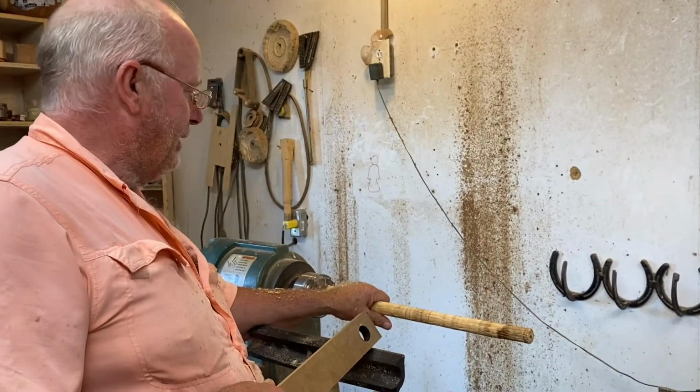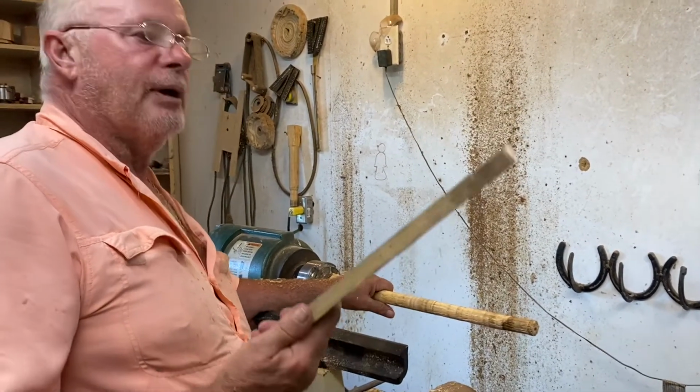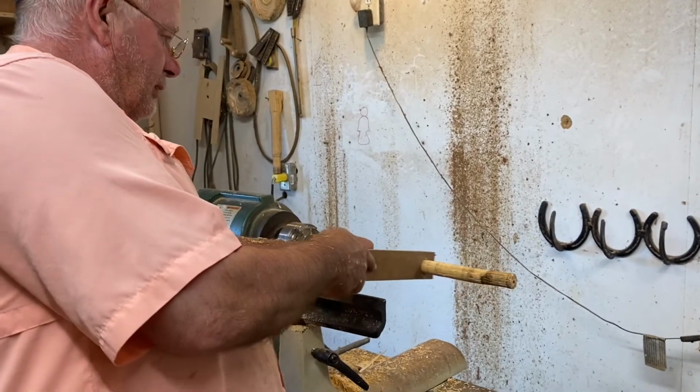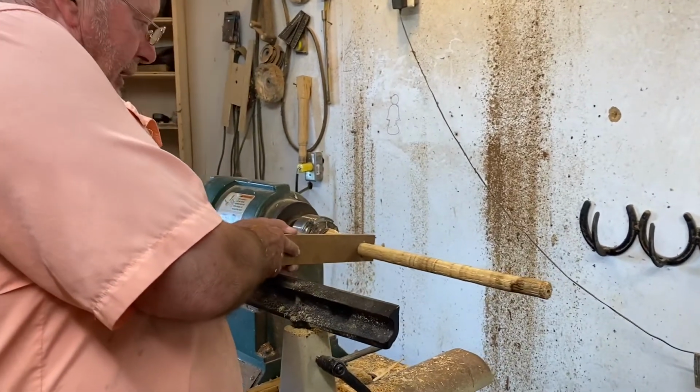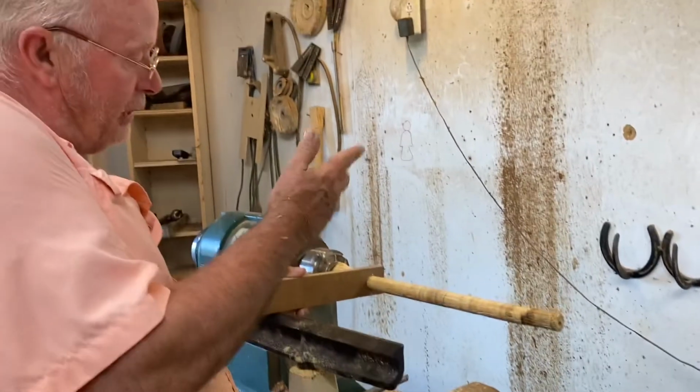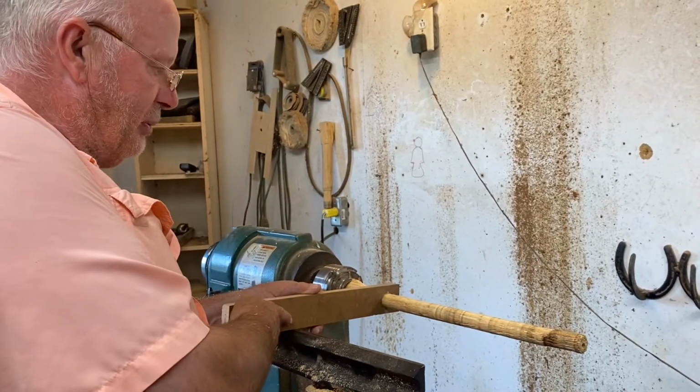Inch and a half by inch and a half piece of pine. Piece of plywood with a 1-inch hole in it. Get it to where it runs all the way down, and you've made a 1-inch dowel. You could have gone to the big box store and bought a dowel, but you couldn't, so you made it. So,